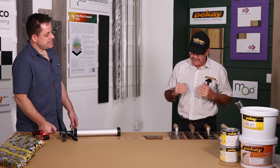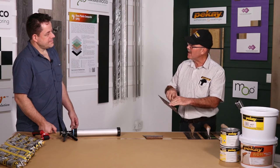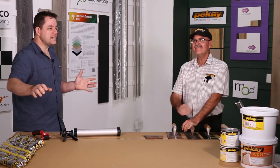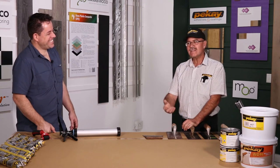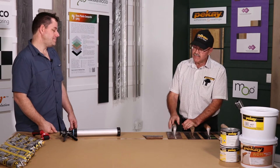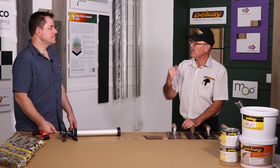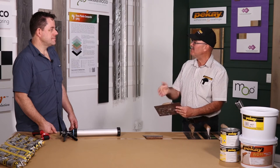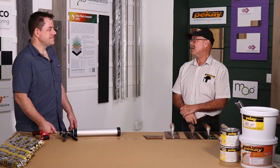The more you use the trowel, the more the teeth wear away — you're scraping it on cement or concrete day in, day out and the teeth wear out. What happens is you apply less and less glue. It's important for applicators to keep those tools clean and to replace the trowel — only do three rooms and then get a new one. We've seen guys taking files to try and make the tools new again, but it can only go so far before you need to get rid of it and get new ones.